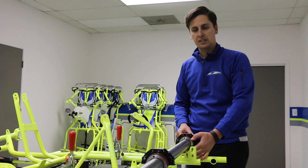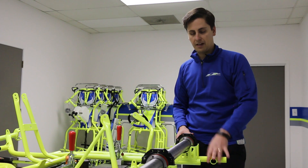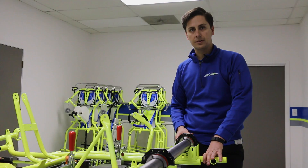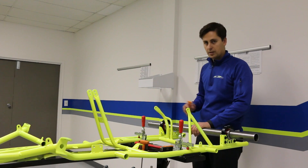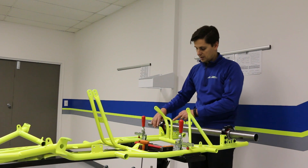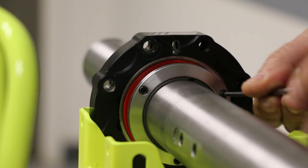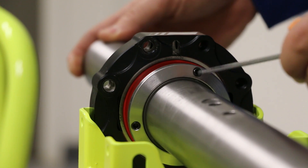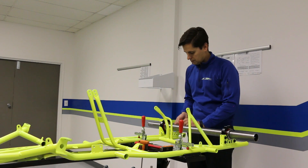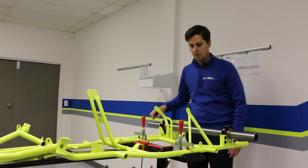We're going to do the exact same process on our other bearing, and now we're fully confident that our bearings have our axle locked and we're ready to go with no issues. Now we're going to go ahead and remove our axle with the SKF bearings. First things first, we need to loosen the set screws on our locking collar — loosen all three set screws. We know it's loose by just spinning the locking collar around.